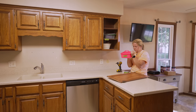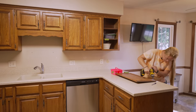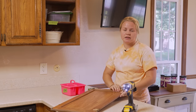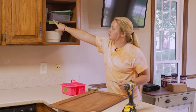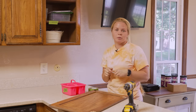As for labeling the actual doors, what I like to do is right inside where I took the hinges off, I'm going to label it there because it's okay if I avoid painting that area since the hinge will be covering it up. That number is going to match right here to right here, and that way I'll still know where that door belongs.